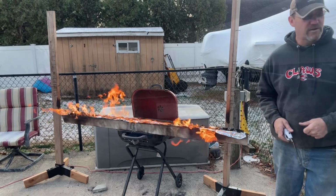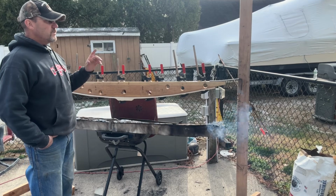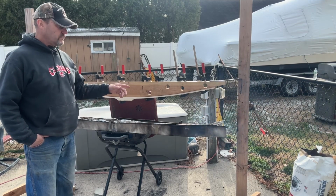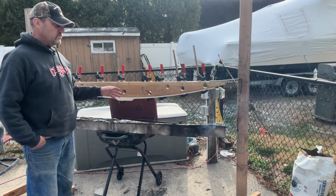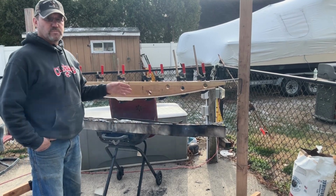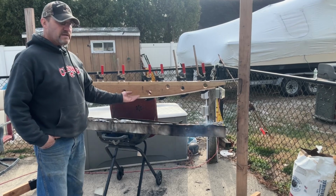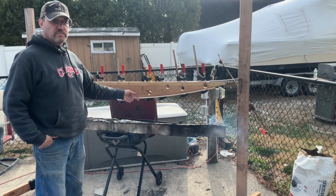Now that's a fire. All right. After we hit it with the heat gun to bend it onto the form, we brought it back here. We wiped it down with a wet rag multiple times. Gave it some time for that moisture to soak into the wood again, to rehydrate it a little bit.